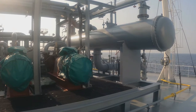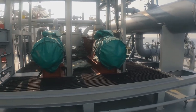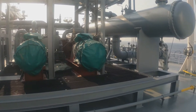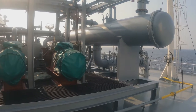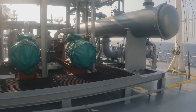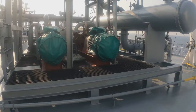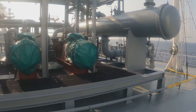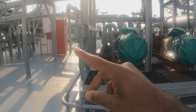If you are in some port, the normal temperature of propane is minus 42.5 degrees, and it varies from plus 2 to minus 2 depending on where you load. Sometimes the port requires you to discharge at 10 or 20 degrees. In that case, you use this cargo heater — passing the cargo through it to increase temperature while keeping it as liquid. We use seawater as a medium to raise the temperature and pass it through the liquid line to the cargo heater, taking the outlet at 20 degrees to the manifold.